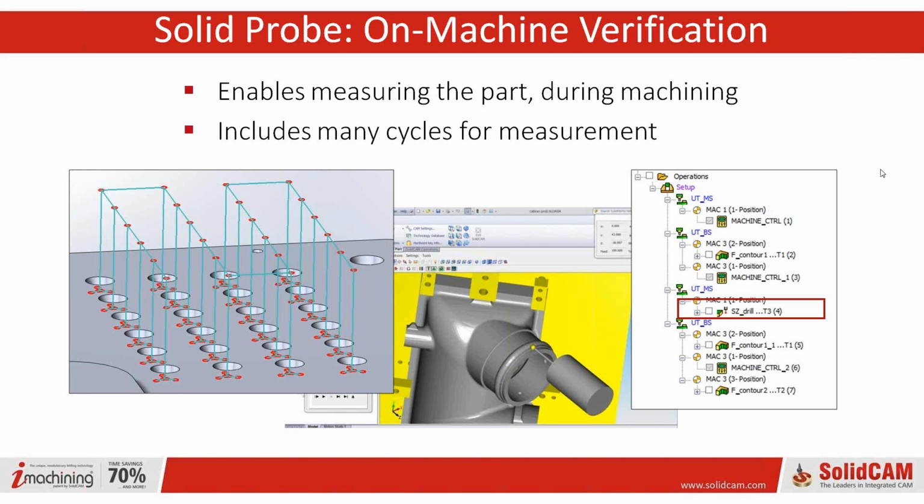What I like about that is that if you get done cutting one particular part where a datum has to be taken from, it can all be done on the machine without any interaction. Once that part is cut, you can start a new probe routine, set a new coordinate system, and then go cut another piece on the part that needs to be in relationship to the one you just cut. And it's all automatic, lights out, nobody has to be at the machine.